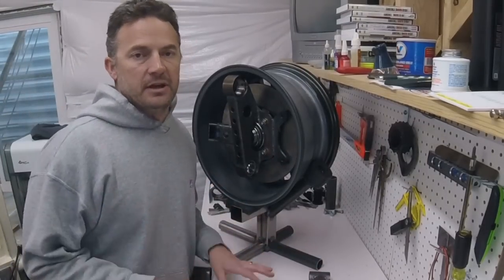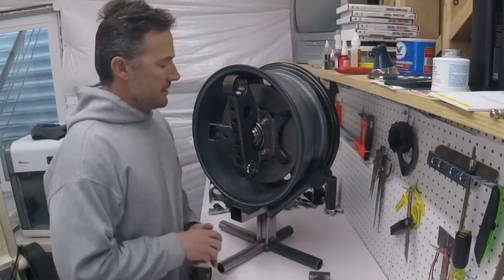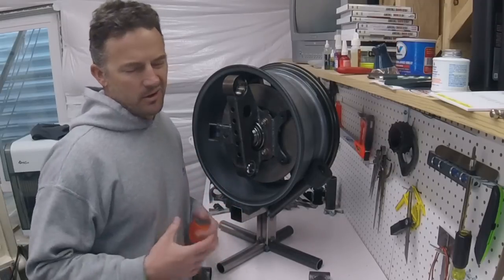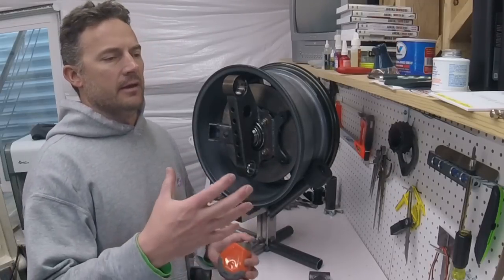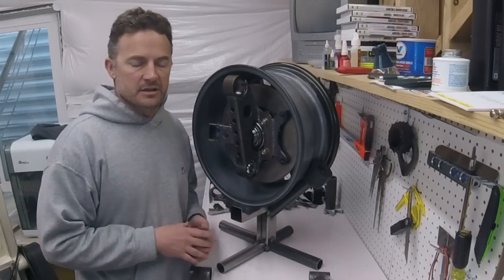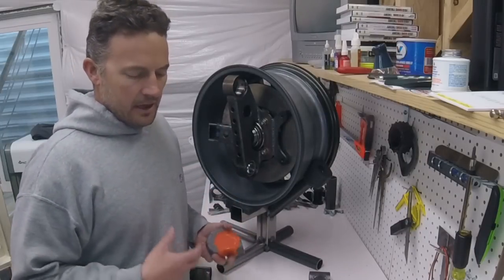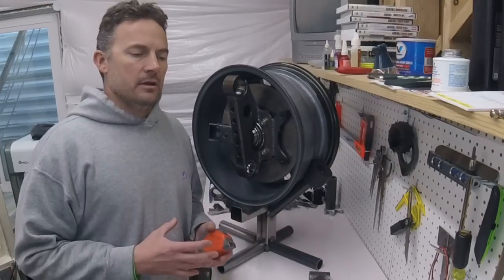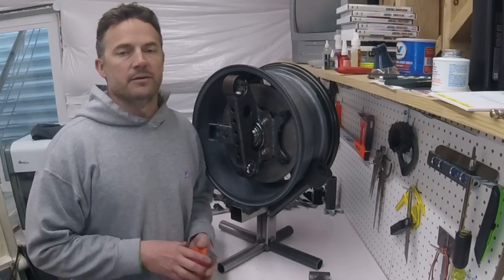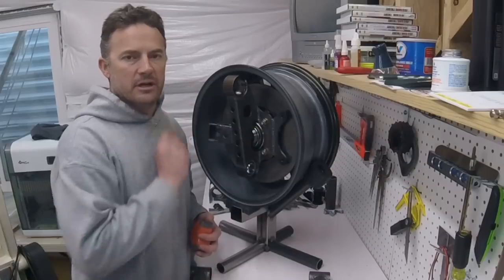So the first thing that I did when I was coming up with this is I took this jig up and I pulled the front suspension, or at least the spindle and some of the control arms, off of my existing chassis, because I'm really happy with that design. I just know that this design, I want it to be a little bit wider and a little bit stronger. So I'm mimicking a lot of the geometry and whatnot that's on my chassis right now.